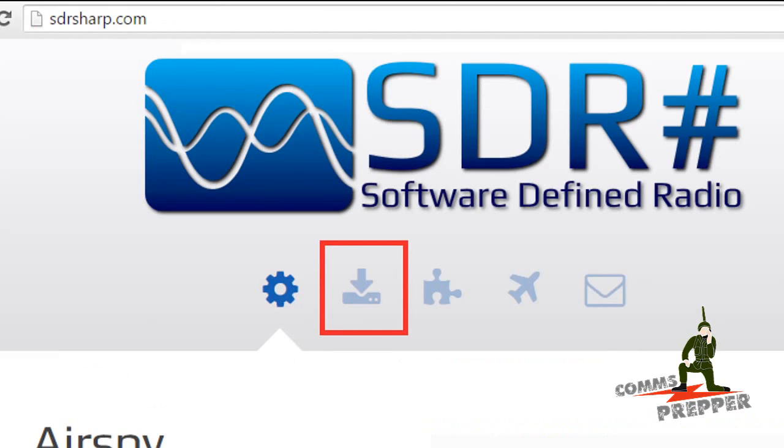The install is very straightforward. The only thing that's a little bit funky is needing to install ZADIG — spelled Z-A-D-I-G — a driver for each USB port you'll use the device on. The simple thing to do is just put it on one USB port and keep it there. That driver has to be installed before the SDR Sharp software. Then I'd recommend, as the comms prepper did, getting it working on FM first — find a commercial station, a ham station, or if you're in North America, a NOAA weather radio — and work out the general principles that way, confirming the unit is powered and receiving signals.